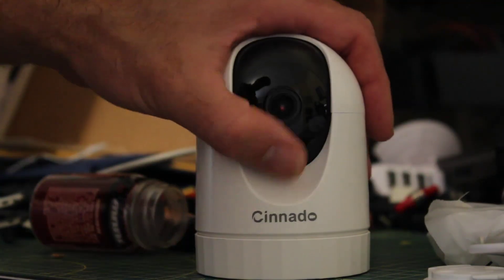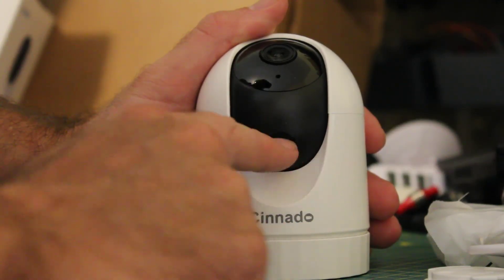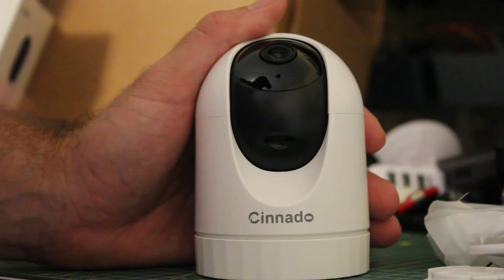On the camera you just lift the lens up here — this is where the SD card goes normally for storage for videos and photos, but that's where we're going to put our SD card with the firmware. You need a micro SD card formatted to FAT32 — that's very important, FAT32 — and whatever size you have is going to work; the firmware is only a couple of megabytes. I have a 64 gigabyte card here just because that's what I have. Once you load the firmware you can take the card out; you don't have to dedicate it permanently to firmware.